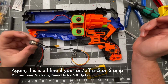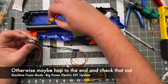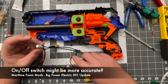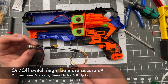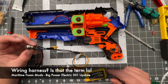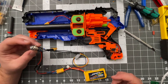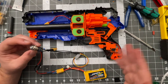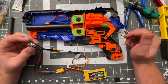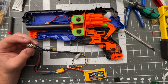I'm going to quickly show what I've done here. I've created a kill switch and voltmeter on their own plug-and-play assembly. This piece plugs into my old power port so it's all separate — in case the switch fails or the voltmeter burns out, I can easily pull and swap them. I really like using connectors so things can be swapped out and be more modular, especially if you make mistakes.